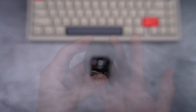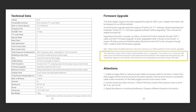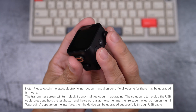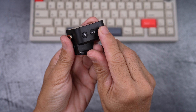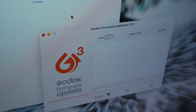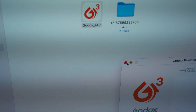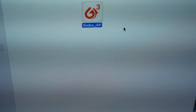If the screen turns black or you think you might have bricked the trigger, according to Godox, you can press both the test button and the select dial at the same time, then release the test button only until 'Upgrading' appears on the interface — then the device can be upgraded again. For me, I just press and hold the dial button until I see the arrow-up icon, then plug it back in with the app open. After everything is done, you can delete both the app and the folder, because you can always download them again — just in case there's a newer version of the launcher and the next firmware together. Anyway, that's all I have. Thank you for watching.